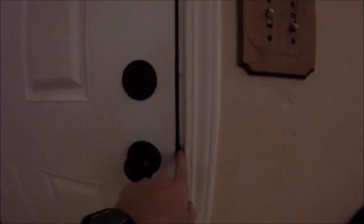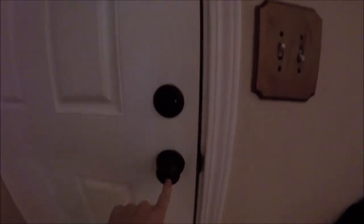Okay, so what I'm talking about is the door lining up, the lock and the door handle lining up with these things. And you know, especially during winter, sometimes when the wood swells, it gets tighter. And on this door, you can tell it's bad because you have to press in on the door to get not only the handle but the lock to latch. See, if you just go like this without pushing in, it doesn't work. So that means I need to fix this area right here.